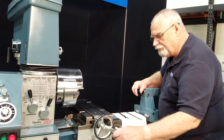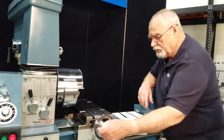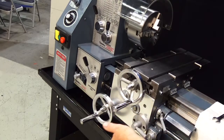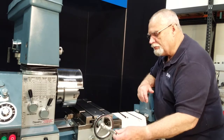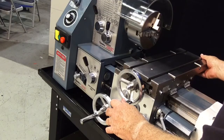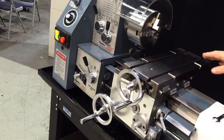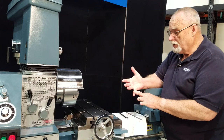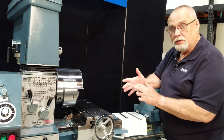Now that you have your gibs adjusted — and in our last video we adjusted the backlash — this axis moves nice and free but doesn't just sit there and spin. There's a little bit of preload on it to keep that accuracy, so your backlash is as low as you can get it and you have no movement in your table. Your Y axis adjustments are done. Now let me show you the X axis adjustments, the tail stock, and the tool post gibs — those other three things also have gibs on them.